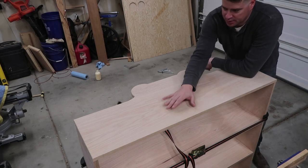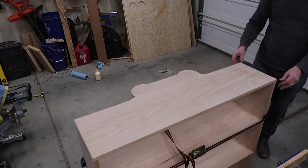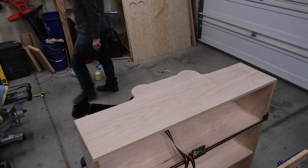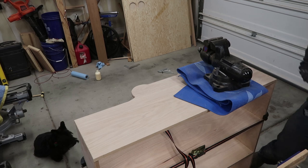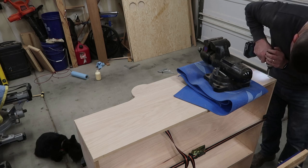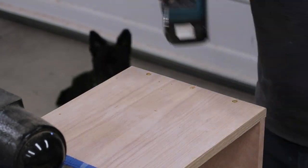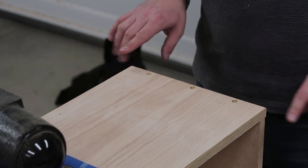What we're doing now is attaching the top. We've got a little bit of a bow on the board, which was probably there before I started, but we'll be able to get it to flatten out. I'm making sure everything is square and flush, putting something heavy on top to keep it from moving around. On the ends I get real worried about it splitting, so I'm taking it easy there. It looks good — we're going to have to sand it out a little bit — but on to the other side.